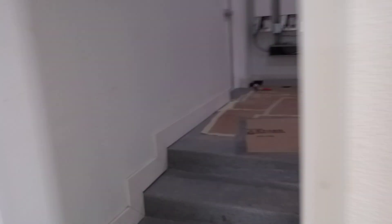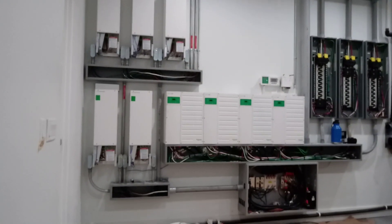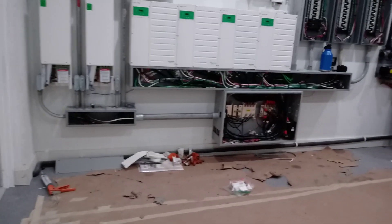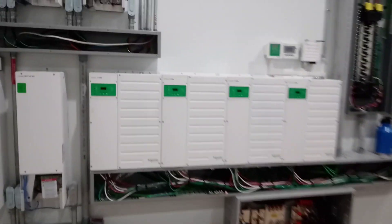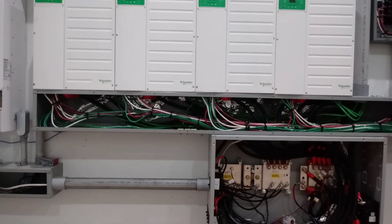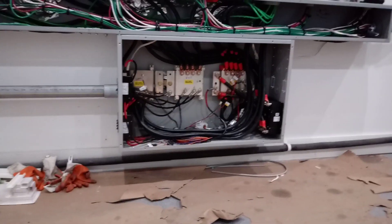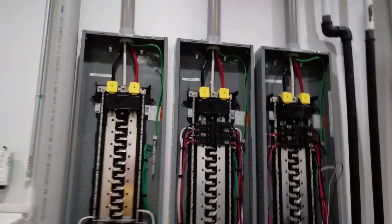These go up in the attic and into our equipment room. Over here we've got five charge controllers and somewhere around 21 kilowatts of PV — that's 60 times 360, just around 21 kilowatts. We've got four Schneider Conext XW Pros. I did a wire trough here because when you go over three of these inverters, the panels they sell you are kind of pointless, and it's a lot more economical to build yourself a trough and then use one of these Midnight Solar 1000 amp DC combiners.